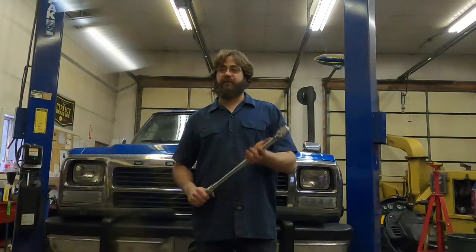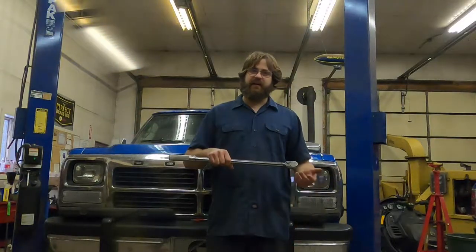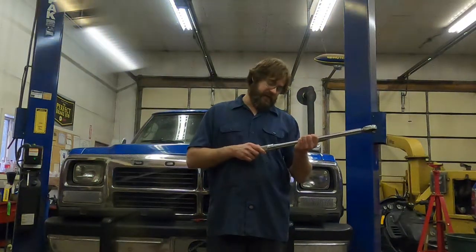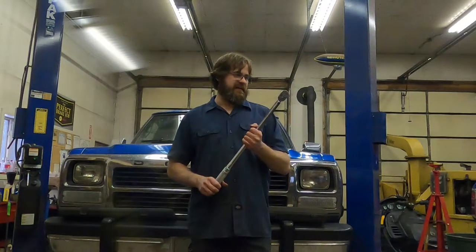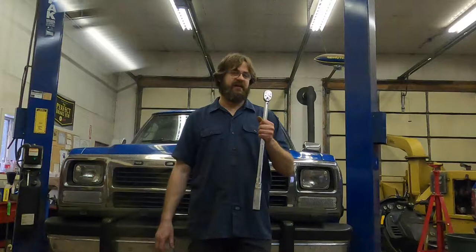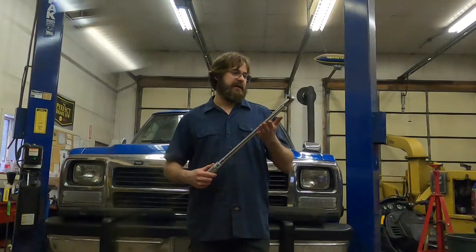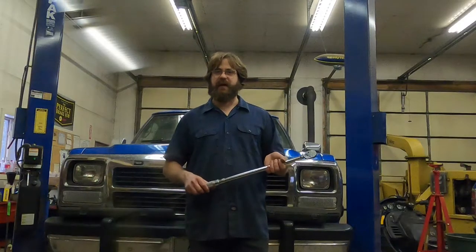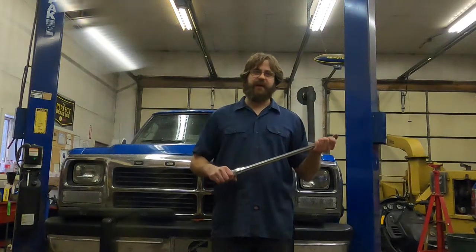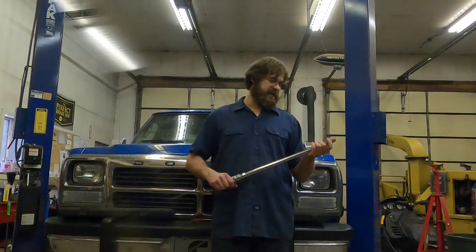The next one is probably the one you're most familiar with — and honestly, if you're learning how to torque stuff, this is probably about the worst torque wrench you can train on. These torque wrenches instill bad habits. When you're properly torquing a fastener, you want it to be very smooth and very even pressure. People tend to jerk on these, jump on them. They don't really have enough strength to torque to the value they're trying to do most of the time, and it gives you inaccurate readings. It'll go click and then people will turn in another eighth of a turn. Really bad for training.